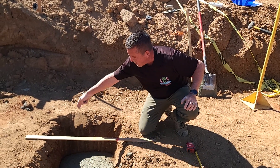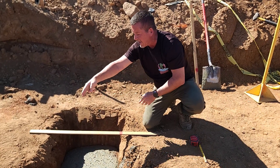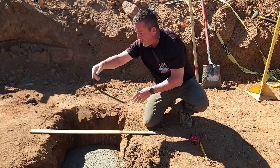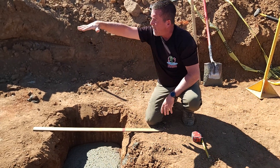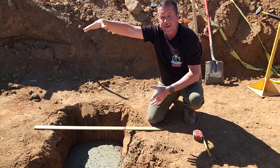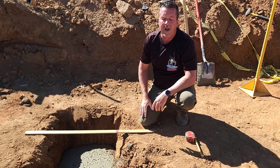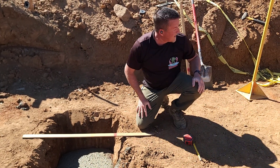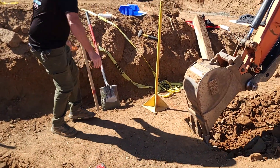We already have our form to be able to set our sona tube on top of the liner, and that's why we over-dug it — so that the rebar can go out this way and out this way at all four corners to be able to hold that sona tube, which is going to be filled with concrete to support the dock. I'm really hoping you guys are seeing step by step how this goes so that you can understand why we do everything that we do.